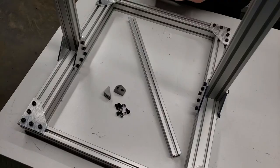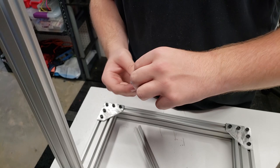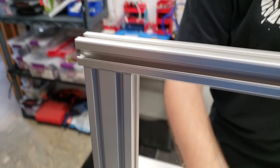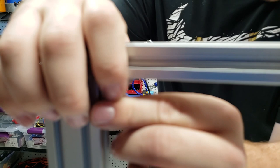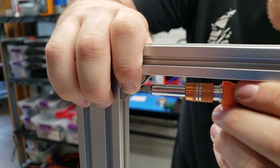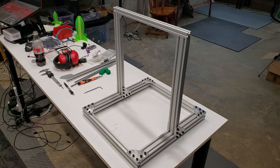Once we have the front and back in place, we're ready to move on to the top crossbar. The crossbar is assembled with these 20-20 angle brackets — simply put the screws and nuts in both ends, and these will join up against the 2040 and the 20-20 at the top. Make sure everything is flush once things are snug. Insert them and tighten slowly once they're in the extrusion. Once you have them snug with a screwdriver, tighten them with an Allen wrench to get into the tight space. Then repeat this for the other side.